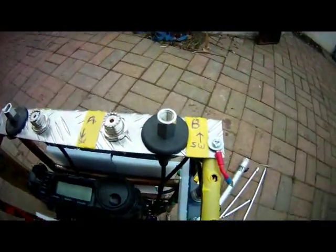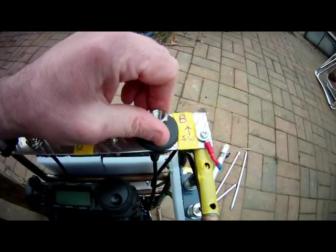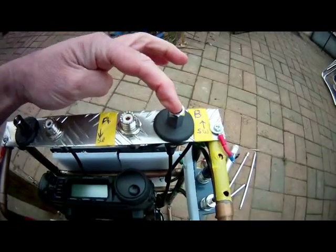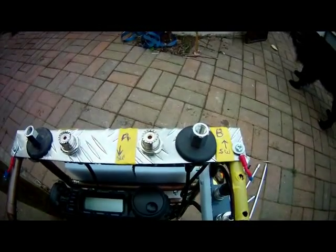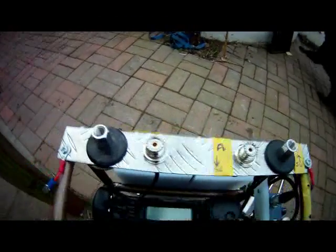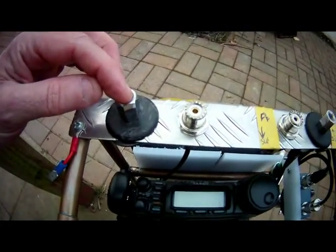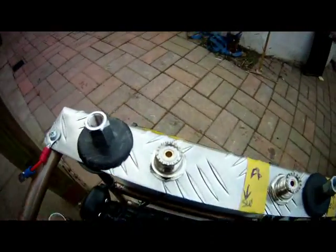There's a two-way RF switch on the side connected to the SO-239 socket and a 3/8 fitting, so I can either have a direct-mounted antenna for HF or a coax going off to a remotely positioned antenna. I've got the same on the UHF/VHF side — a 3/8 mount and an SO-239 mount.